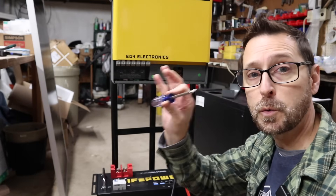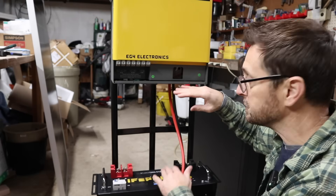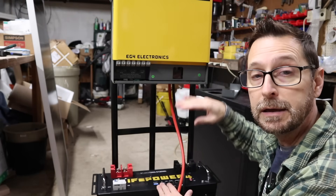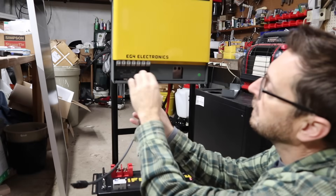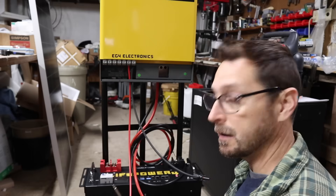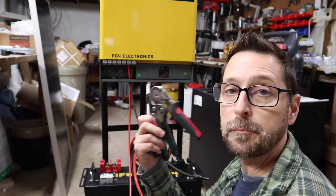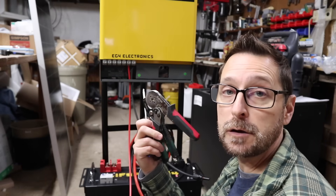The battery terminals use a square drive electrical screwdriver. You can see the taller your hand cart, the better — I've got a lot of room to play with between the battery and the bottom of the inverter. On the bottom of the inverter it shows which side is positive and negative: negative is on the right, positive is on the left. You're going to need to sneak your screwdriver in to loosen the terminals and get your wire through the bottom. I always have all of my tools listed in the description below the video as well.